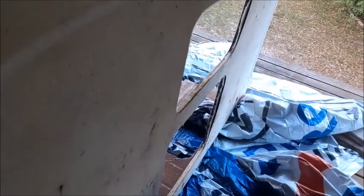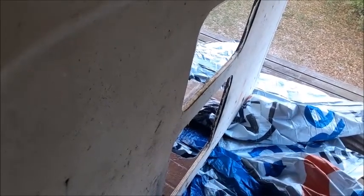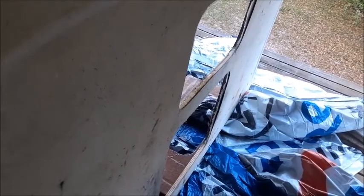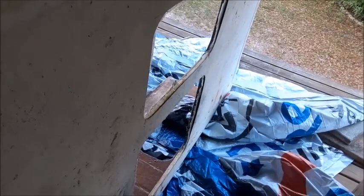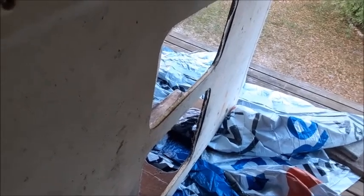I think if I was to do this over, I would do it without the mat, and then I would just pour the resin over the top of the plywood and quickly swash it all around with a paintbrush and set the thing in place. With two people, the time it took us to saturate the resin into the fiberglass mat was right around 8 minutes, and we started to get tacky on our fiberglass, so we had to prematurely go ahead and put the fiberglass deck over the top of the plywood.